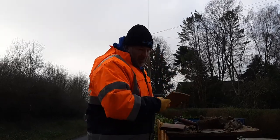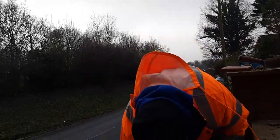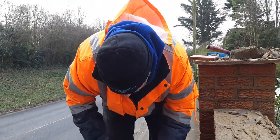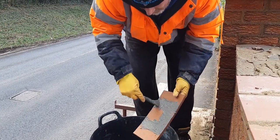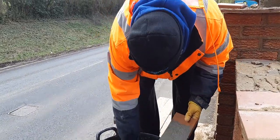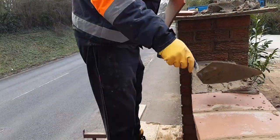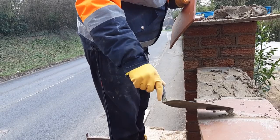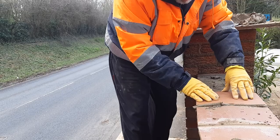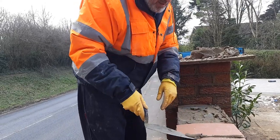So what we're going to do now is slurry the back of this tile, but we can't slurry the edges that will be seen underneath. So we'll slurry that there, and we've done this with every one coming along. Brad's been picking that up. So that's all slurried up now — put that on top of there. You've got your combo: your sand and cement slurried to the one underneath, and you've got this one slurried to your combo.